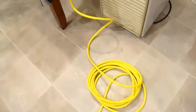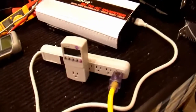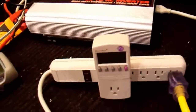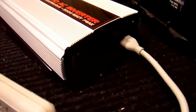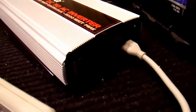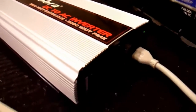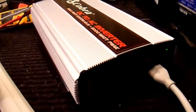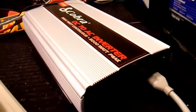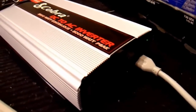I have it powered through a 40 foot 12 gauge extension cord, which should be roughly equivalent to your in-house wiring if you wanted to power it through that. It's a nice heavy cord. I have it plugged into this power strip, which is off right now. I'm going to turn on the power strip and see if the refrigerator starts up. So it took a pretty hefty surge to get that refrigerator started — the bar graph went up a good portion of the way. It probably took a 1,500–2,000 watt surge to get the thing going, but it is running.